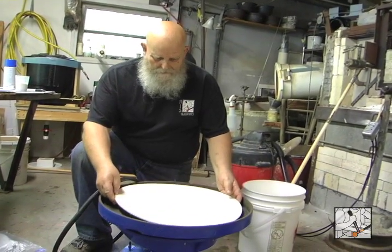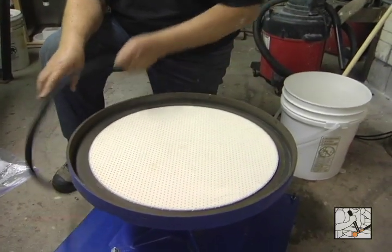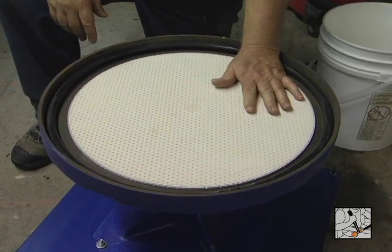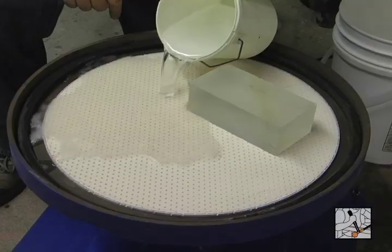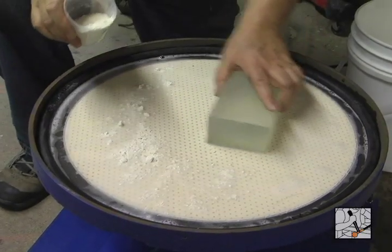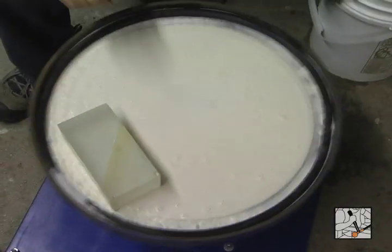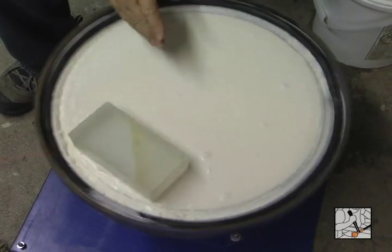This is our synthetic felt — magnetic, cut a little bit smaller. We want the glass to go over the edge and not deform the felt. The re-cleaned bumper: the glass will move around on here, over the edge, bump into this — still safe for the glass. The glass that we're using has gone through the 600. The felt will absorb a fair amount of water to begin with. A little bit of Cerium Oxide, and again, the weight of the glass is going to do all the polishing. The little holes in the felt will act as containment so any small contaminant falls to the bottom of the hole and will not sit on top and scratch the glass.